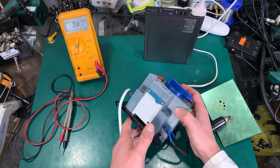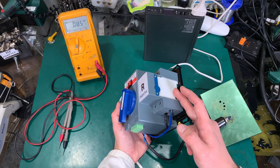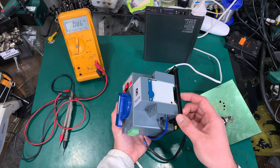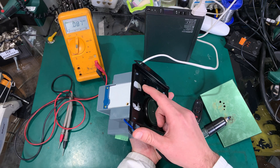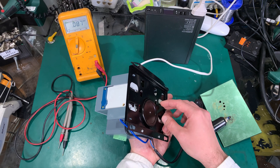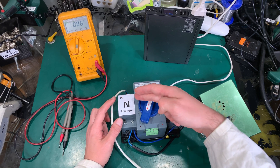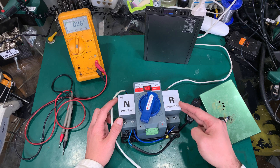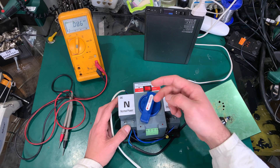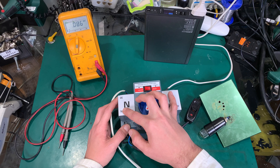On one side and on the second side, you've got something that looks like a fuse or a circuit breaker, but this is actually an isolating switch designed to be mounted on a DIN rail. And this is exactly what you can see here — you've got a mimic of a DIN rail and these two isolating switches connected. There is a mechanical steel rod that, as shown in the manual, will interlock these two isolating switches so that only one of them can be enabled at a time.